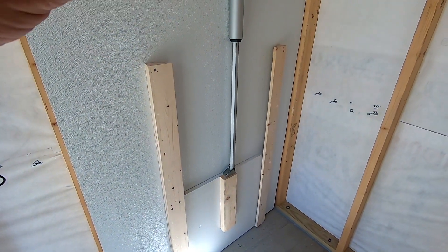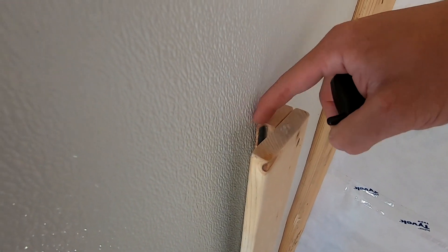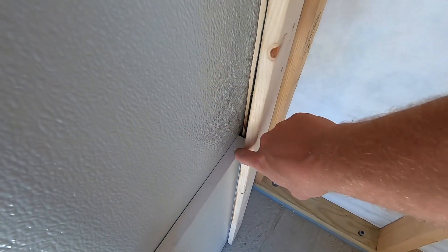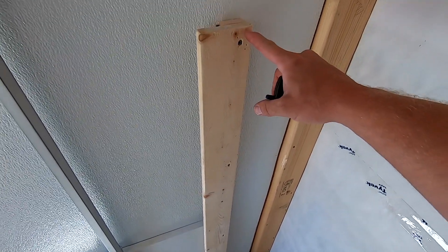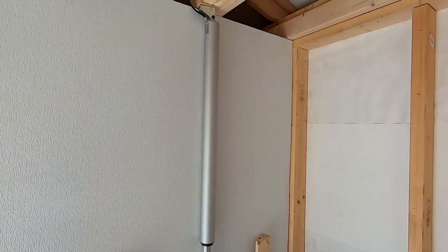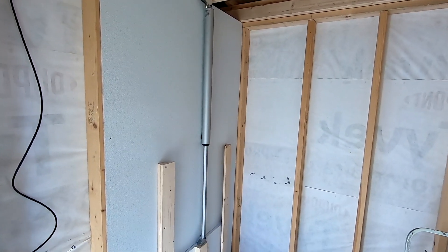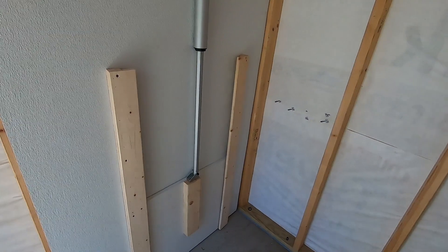I started out building it how you would build any manual dog door. I basically made a track out of wood — you can see there's this inner area and it's just a slightly over three-quarter inch board. I took some door weather strip and put it in there, also on the front of the door to keep it from binding. There's an outer board — since the door is two feet wide, this is a four-foot board. If you wanted, you could just tie a string where the actuator is connected to a pulley, and if you had a cage you could open and close the dog door with a rope on the pulley, similar to a setup I had in the past. But I thought it'd be really neat to have an electronic setup so I could open it from the back door of the house.